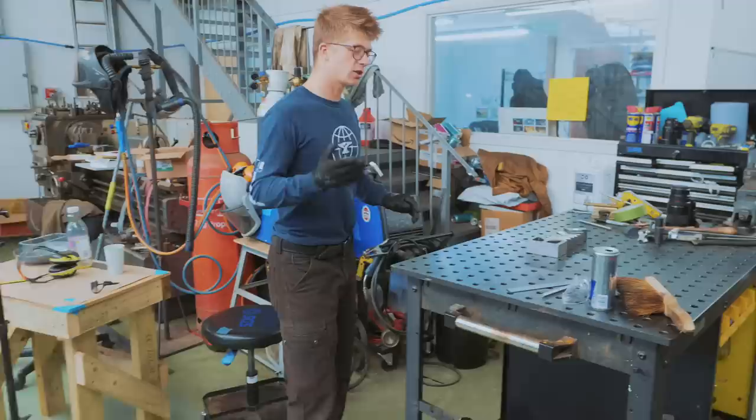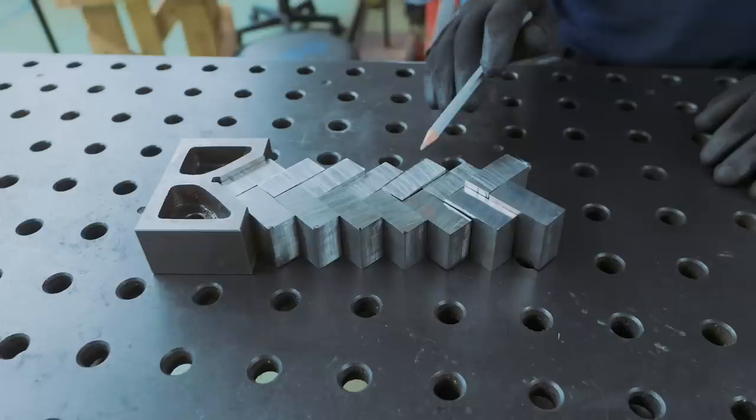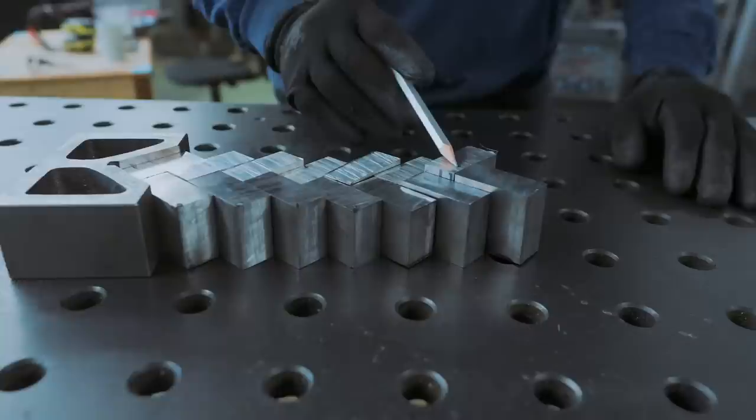The trouble with cutting high carbon steel on that circular saw is as the blade gets dull, on the high carbon, it begins to wander. You can see our cuts aren't square. You can also see this one's really long, and the reason for that is I dropped my set square and it added an extra 1/8 of an inch to its length.